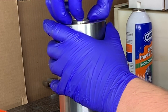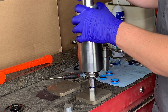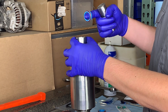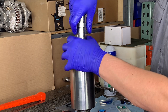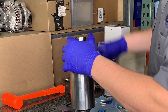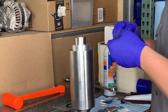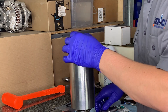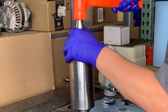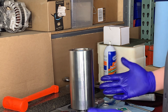A portion of the spacer tool will be exposed — remove the spacer from the cylinder and set aside. Next we're going to grab the locating tool and place it in the recess of the cylinder like we did on the other side. Place the sleeve tool in next with the taper side facing up. Grab a single high-pressure seal with the red O-ring and install into the sleeve tool, remembering to keep the red O-ring facing downward. Take the seal installation tool with the flat side and press downward until the seal is properly seated inside the cylinder — you may need to use the mallet. Grab a hoop next, apply a little bit of high vacuum grease, and remember to take the taper side or knife edge and face that down towards the seal. Grab your seal installation tool using the flat side, press the hoop down until it bottoms out, then take the mallet and give a fairly firm strike to seat. Remove the seal tools and check that the hoop and seal are flat to the face of the cylinder.